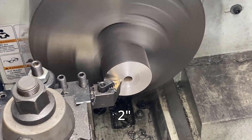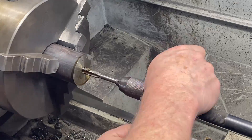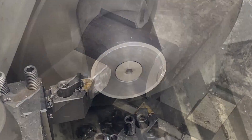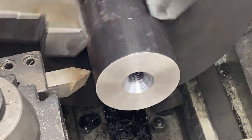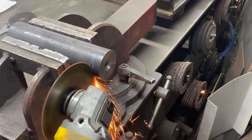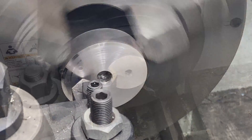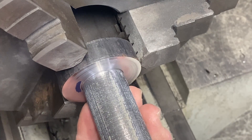The next step is to work on the base. This is a piece of 50 millimeter solid bar. I'm drilling an 8.5 millimeter hole so I can tap it out to M10. I'm going to use a countersunk bolt so I need to countersink the hole. I've tightened up the bolt and I'm turning the bottom so it's all nice and flat. I broke the parting tool on the lathe a while ago so I'm going to part this off a different way — quick and easy with an angle grinder. That's put back in the lathe and tidied up. I'm putting a mark on here so it's going to be easier to line up the pipe for when I weld it.